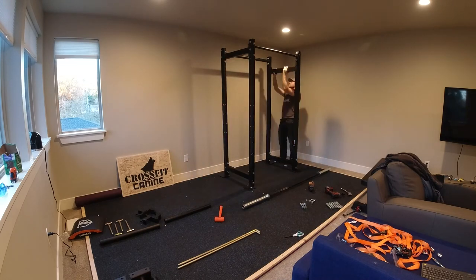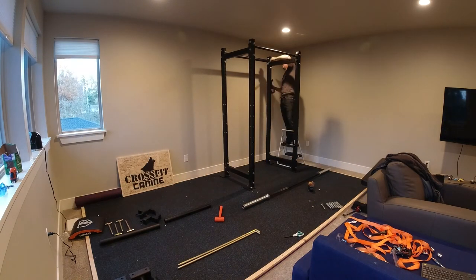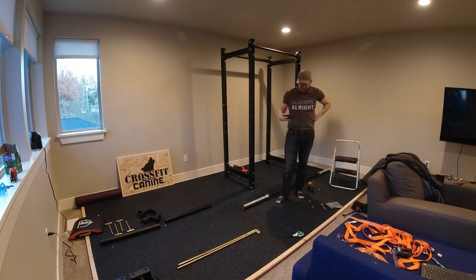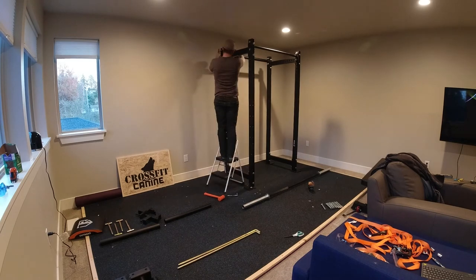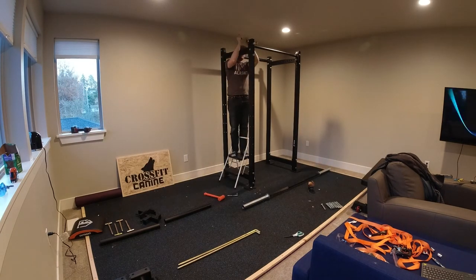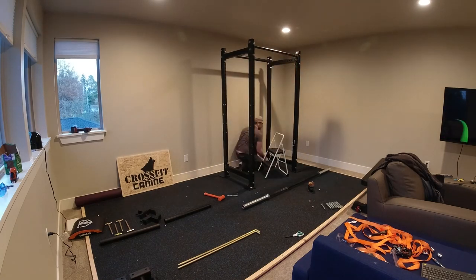So for anyone wondering if you can put a small gym upstairs in your spare bedroom, I say yes. Just be cautious. Keep track of how much everything weighs and compare that to the standard residential load ratings of 30 pounds per square foot. The second story of a residential house isn't the place to be hosting deadlift competitions, but otherwise, within reason, should be just fine. All right, take care.